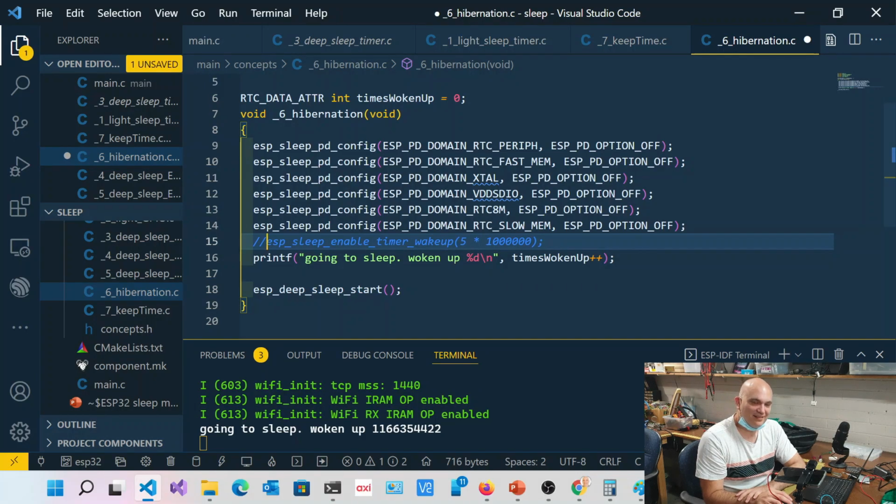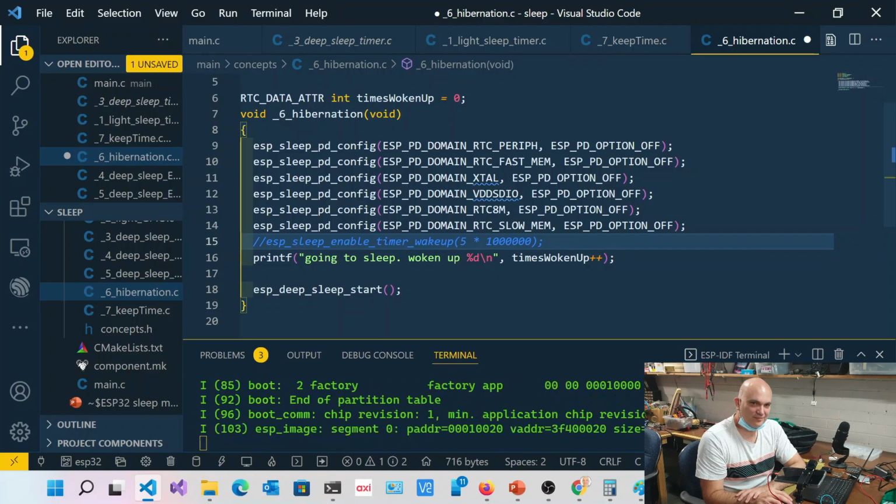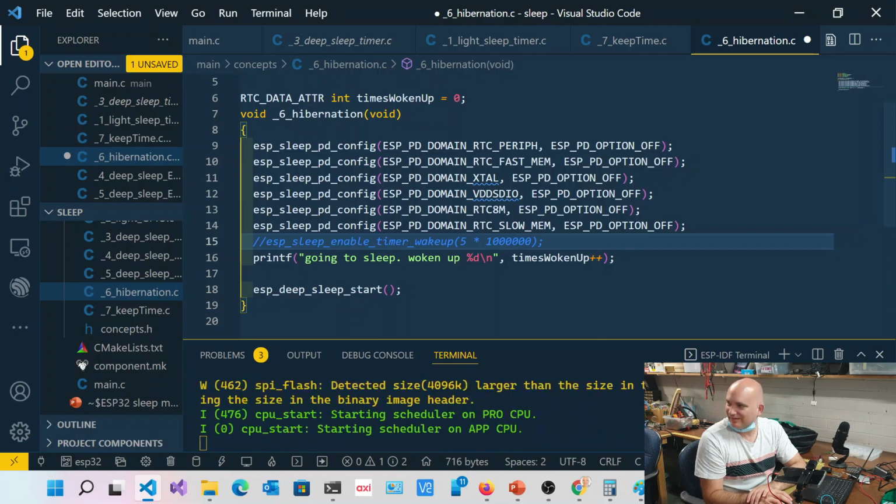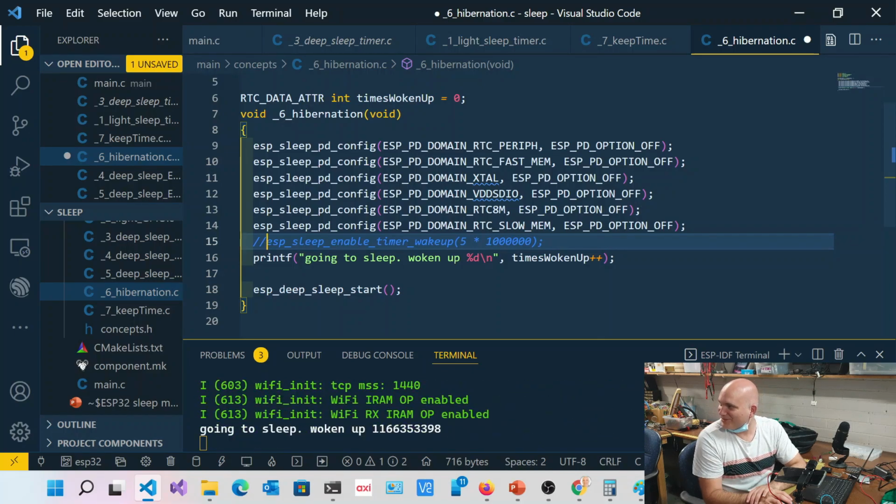So that says to me that if you're doing something simple like a reed switch triggered circuit, you'd be crazy to have any external circuitry. Just let the chip do everything. That's right. And literally, you go online, you spend a couple of seconds just sending an email. I've got the code to be able to, using SendGrid, just send an email saying, yeah, you got mail, that's it. You got electronic mail that's telling you that you got real mail.